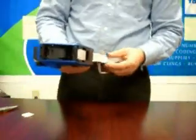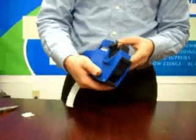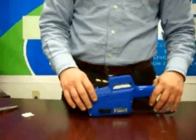I recommend you change ink rollers once every 10 to 15,000 labels. That'll make sure your print head lasts a while, because if you allow the ink roller to get dry, the fibers from the foam in the ink roller will get stuck inside the bands and start making your sixes, nines, zeros, and fours print improperly.